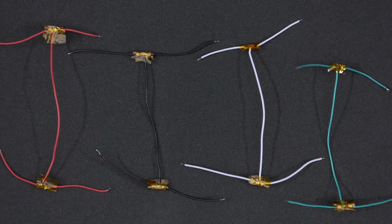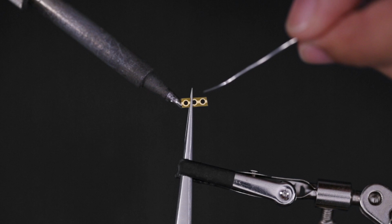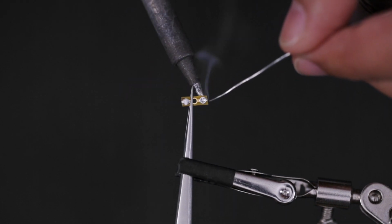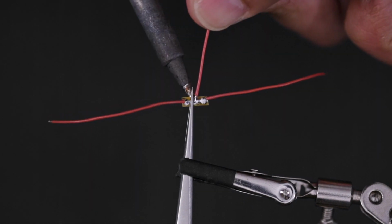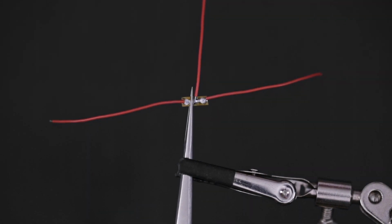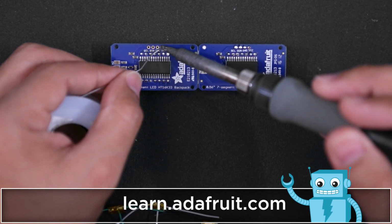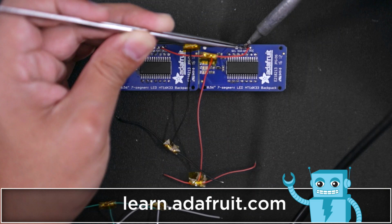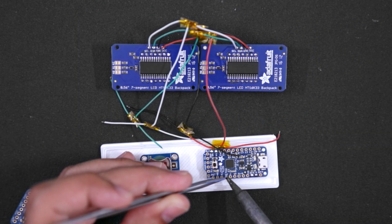4 connections are chained between the circuit, plus an extra wire for the Pro Trinket and RTC module. A great way to easily chain these connections is to use a piece of flexible PCB. You can cut out a small strip using scissors and save the rest of the PCB for future projects. Check out our guide on the Adafruit Learning System for a circuit diagram and demo code for setting up the countdown date. You can type in your desired date in the Arduino sketch.